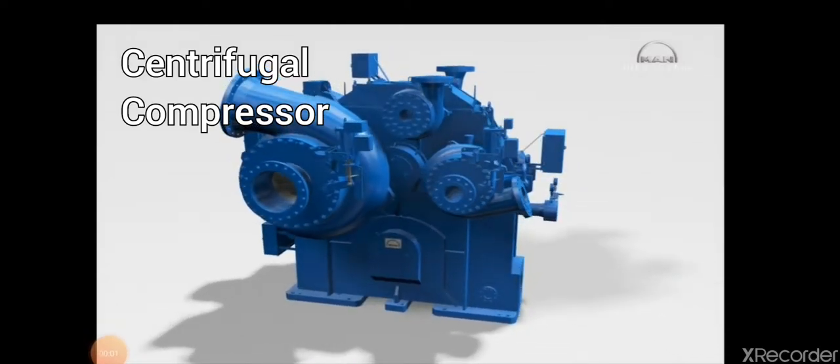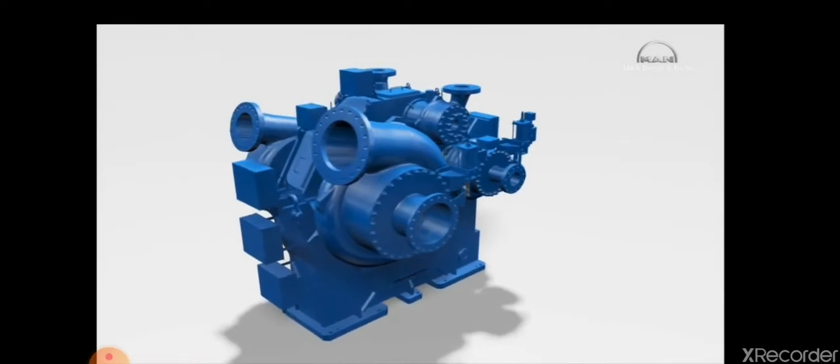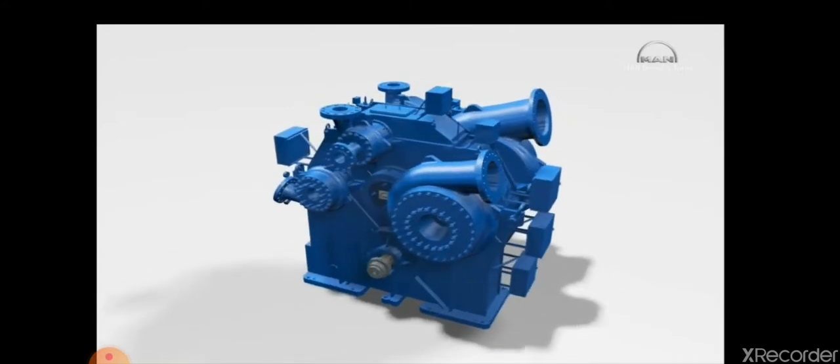The 8 compressor stages are arranged around a gear unit in the same way as the hands of a clock. The basic principle is the same in that only one drive unit is needed to rotate them at different speeds.